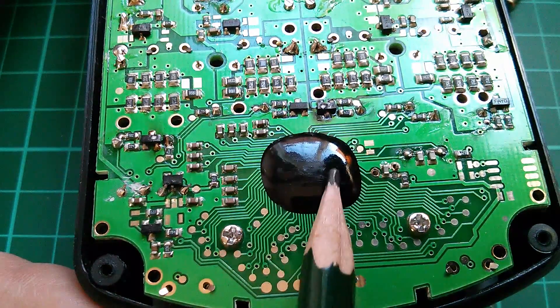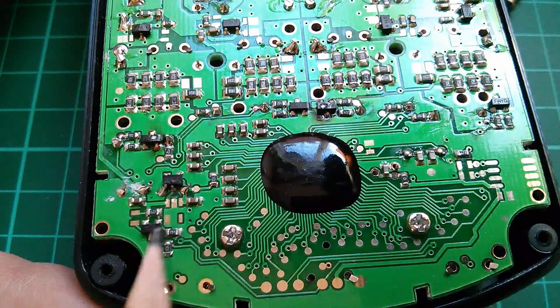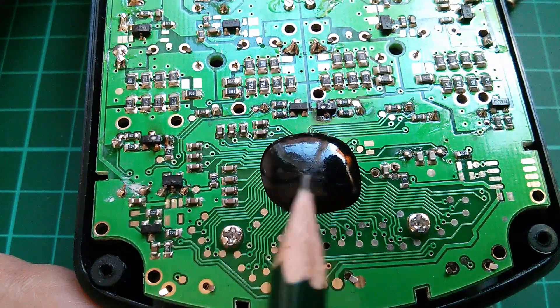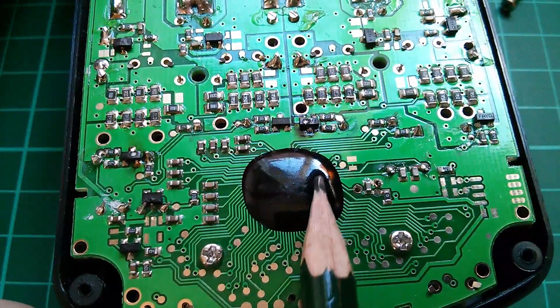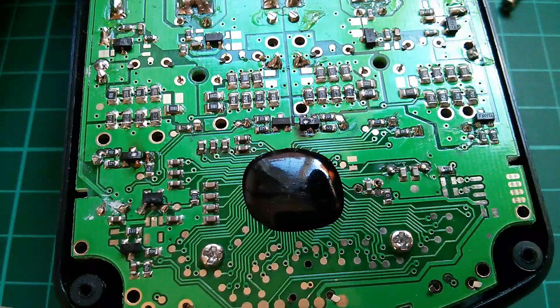I don't think that's the major problem, because this chip clearly runs directly off 3 volts, and I can't see many components around here that would protect this chip against 12 volts being put in on the input socket. So I'm pretty certain this chip's gone.